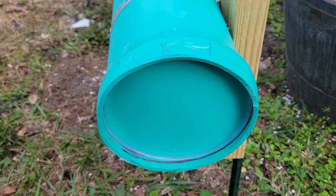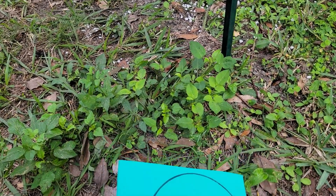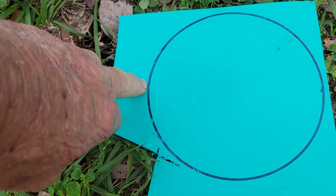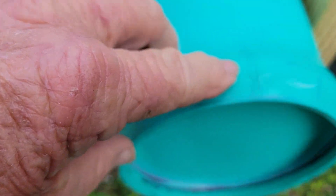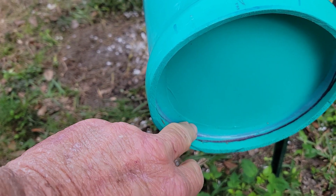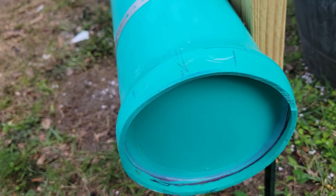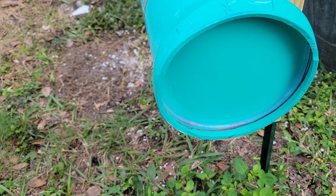I didn't do the end like I said I was going to. I flattened out some more of this material and cut it out on the outside of the black line so it was a little bit bigger than the pipe. I took my heat gun and heated it up - took about five minutes - made it real pliable, stuck the piece in there, and took my hammer and put it in. I drew a line to know how far to go in, and I did silicone on the inside and outside just to make sure there wouldn't be a leak.